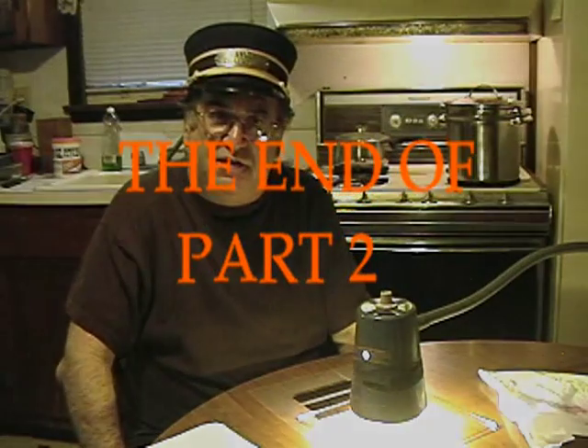I've found a lot of different things to do with etching. I've made triple-depth etchings — where I etched so far down, blocked some of it off, etched a little further, blocked some more, and made different levels that way. One thing you should know: the Sharpie pen is resistant to the acid. You can color in any flaws in your artwork and it won't eat through it. You can even sign your name and it'll come out. Give it a try — you can make some really neat looking stuff for your locomotive.